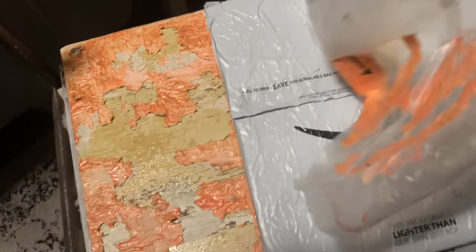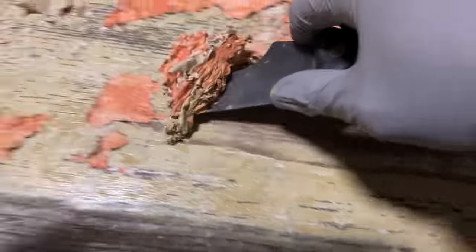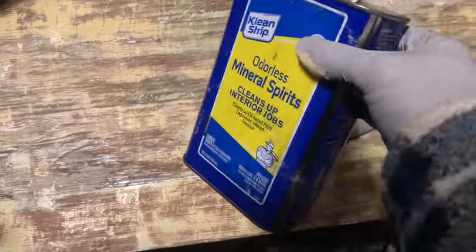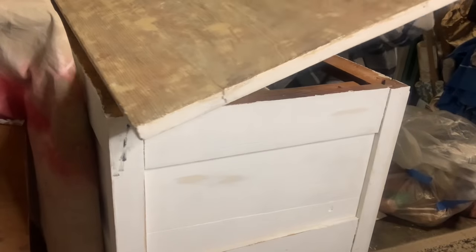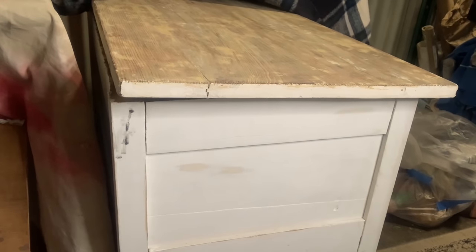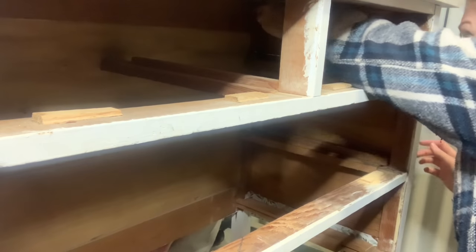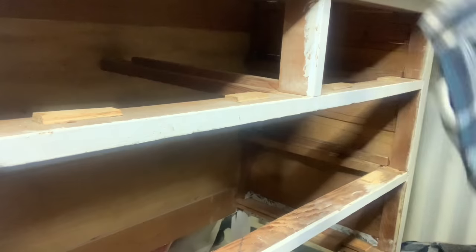This has been sitting overnight and as I'm lifting off the plastic you can see the paint just wanted to come off of this thing — it was just coming off with it. So that'll make life a lot easier. Got this done, stripped it all back, and then went through with some steel wool and mineral spirits and got it cleaned up so that we can reattach and prep it. I'm using all of the same screws that it came with — I do try and do that as much as possible. In this case all these screws were still in great shape, so I used those same screws to reattach them, and this will give me something easier to sand on instead of it wobbling around everywhere.